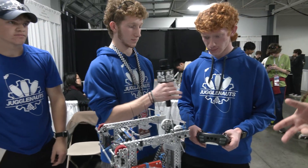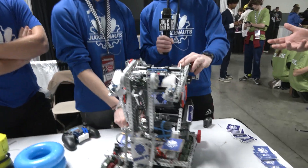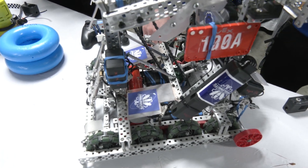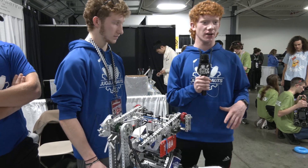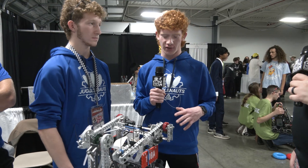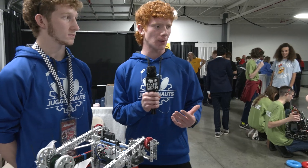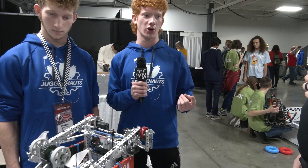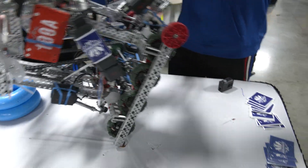As we wrap up here, Corey, one of the cool things we're going to do — your team is running a 55-watt motor drivetrain, which is a little less than some other teams we talked to. But your team has found a way to figure out if your motors overheat to get it ready for the next match. So the six-motor drive has kind of become the meta and almost all the good teams run it now, but we really wanted to have our two-motor intake like we had at Mall. It worked super well. We tried the one-motor intake at a local competition, which worked, but just wasn't as consistent. So we went back to the two-motor intake, but now we have one more motor to account for — this is where we went to the five-motor drive, or the 55-watt drivetrain.